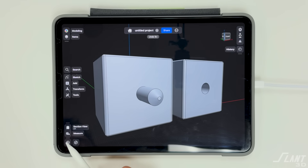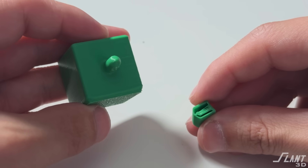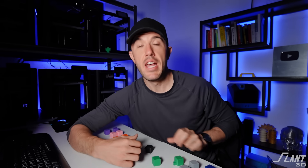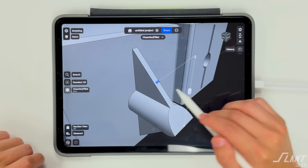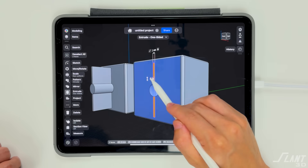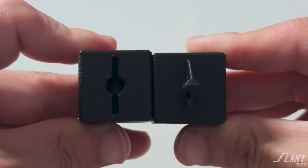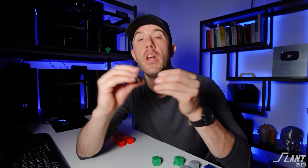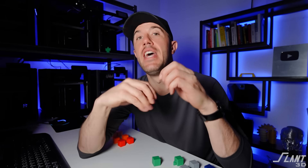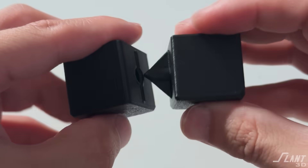Let's go into more advanced techniques. Rather than wasting the support material needed under the pin, why not use it as part of the design to improve rigidity? You take the pin and apply a chamfer to the bottom and top so it can be printed in any orientation without needing support to hold its shape. Mirror it on the other side to create a keyhole. This lets you use those flanges as tension areas where the side walls - which are much higher tolerance - slide together, without relying on the tops and bottoms of the pin interfacing with the hole. It's more reliable, uses material rather than throwing it away as support, and gives a much stronger side feature.